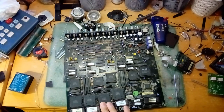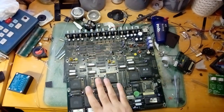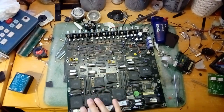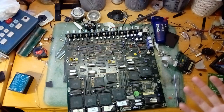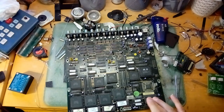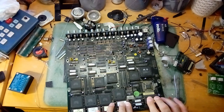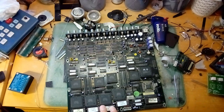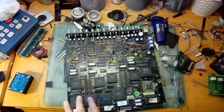One thing that's quite interesting is these aren't FPGAs — these are the predecessor to FPGAs known as CPLDs. They're basically the same thing but just on a smaller scale. And these are all their configuration EPROMs. I might read these at some point, but I don't have any inclination to do it right now, because it's just going to be control data and configurations for these.